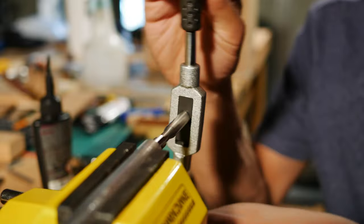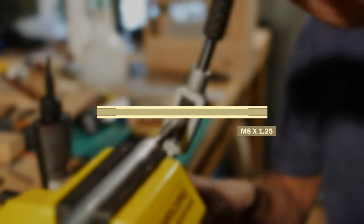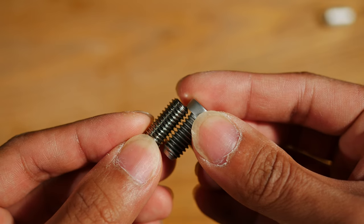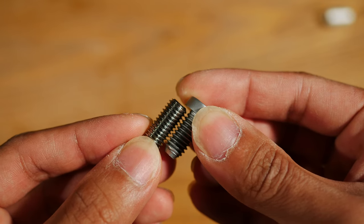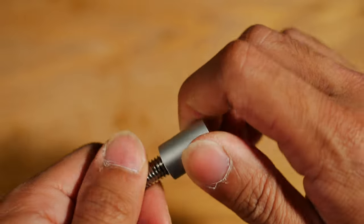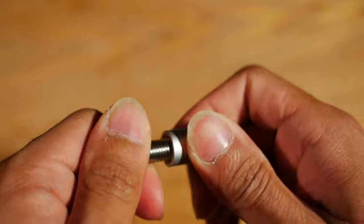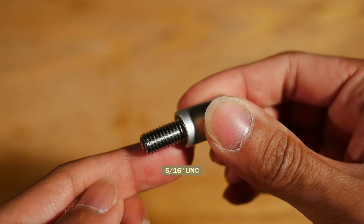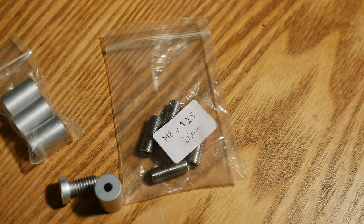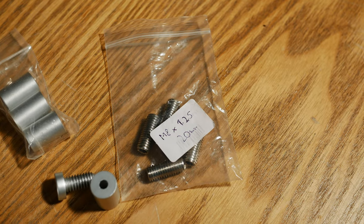But here's yet another doozy. The side that screws into the box is M8, while the acrylic side is not. This dawned upon me when the stubby standoffs won't thread onto an M8 tap, thus the screws won't thread onto an M8. What is this, you may ask? 5/16 UNC, requiring a new tap. I could have used that all around, but we already had M8 grub screws.